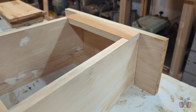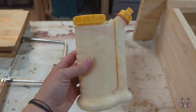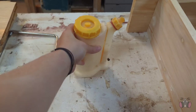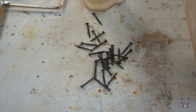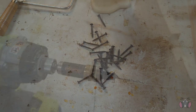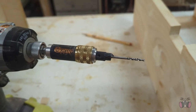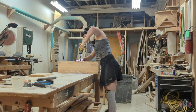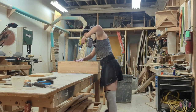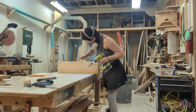I think it's ready to get screwed in. I know I said I plan on using the wood screws that I salvaged from the shelves, but I'll double it up and also use glue so everything is extra safe. I also used a countersink bit to pre-drill the holes, because I didn't want the screws to stick out and cause any snagging. Then I pre-drilled the holes, added the glue, and screwed everything in — and I did this to both chairs, both sides.